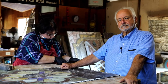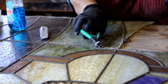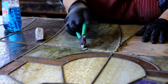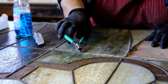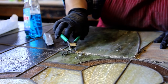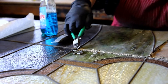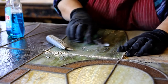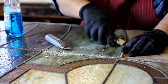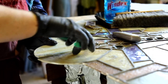You have to cut away the putty — there's glass, lead, and putty to make it reinforced and waterproofed. But the putty has gotten kind of chalky and the lead's gotten kind of brittle. So you have to take the putty out and then take away all the lead, like she's doing now — you have to kind of scallop it away. Then when you get enough of the lead off, you can take the piece out. Then you have to clean each piece, which is laborious, to remove all the old putty — it's linseed oil putty, which gets hard as a rock and kind of chalky. So it's really a process to take all that old putty away and clean the glass so you can re-lead it.